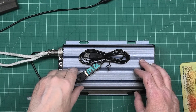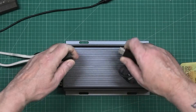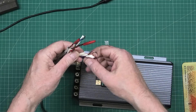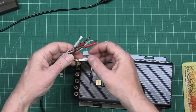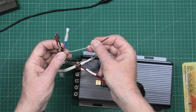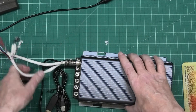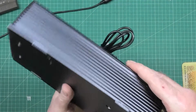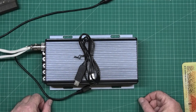If anyone wants to buy an SVMC 72150 which has been unlocked, there's one here. Comes with a programming cable and USB lead — doesn't come with Bluetooth — but comes with all the cables which have been labeled: high brake, low speed, high speed, e-lock, five-volt brake, thermistor temperature sensor for the halls, and all the hall wires and throttle. It's got a few marks on it — well worn — but it's worked absolutely flawlessly. Make me an offer.